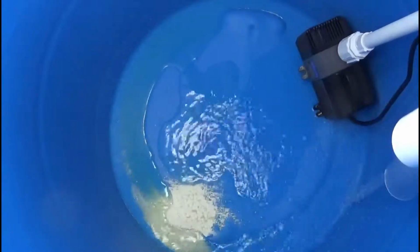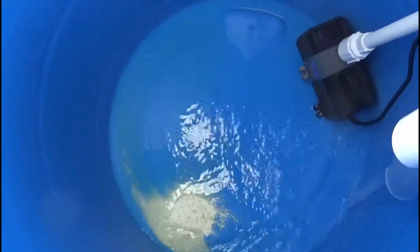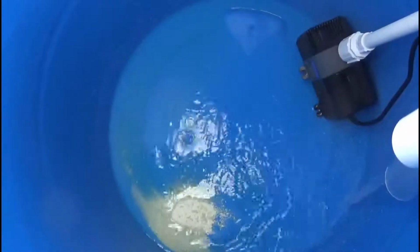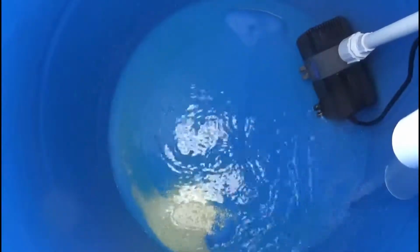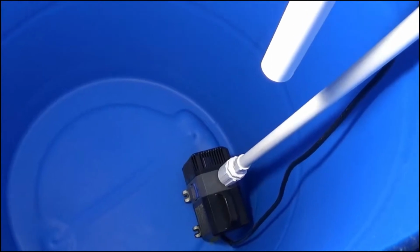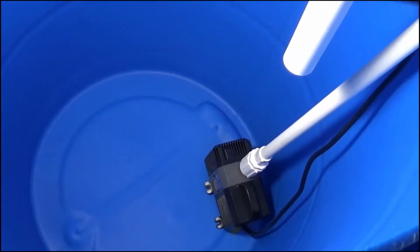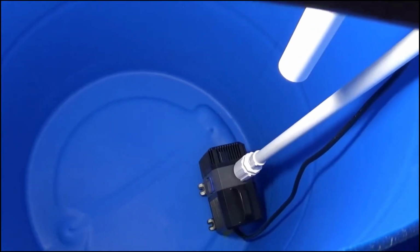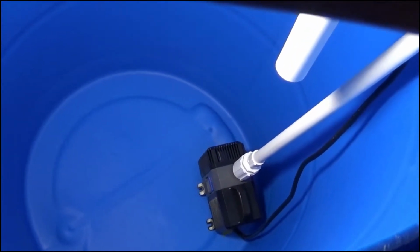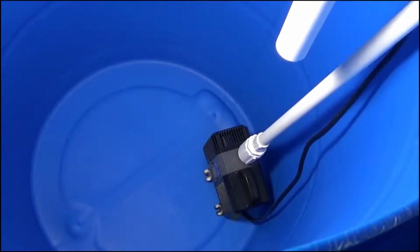Now, with the PVC pipe, what we're going to be doing is running a pipe from our pump, which is a physical submersible pump, that's going to go down. We're going to be attaching 1/2-inch PVC pipe that runs up to the very top of our tier using 90-degree angles. Then we're going to be branching that PVC pipe into 3 systems, so that way it will drain down, and we're going to spread out the flow between 3 different sections. The reason why we're choosing to do 3 different sections is so that way we can get as much water dispersal as possible when it flows in.